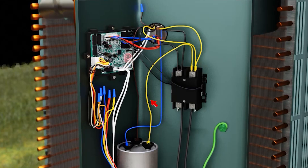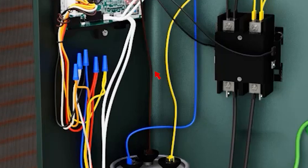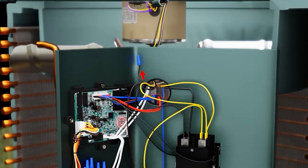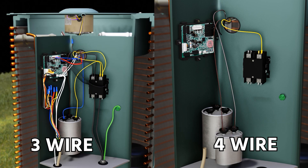In the case of three-wire, you're just running a jumper from wherever this white wire lands to the other side of the capacitor. To make it simple — when you're looking at a motor, these two wires are your power leads. The brown wire with no white stripe is your capacitor lead. And your brown wire with a white stripe is your capacitor lead that's just jumpered to that one other leg — generally it's going to be white or yellow internal to the motor. Here in this 3D illustration, we show you what it looks like specifically to do both the three and the four-wire wiring methodologies.